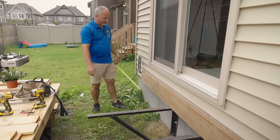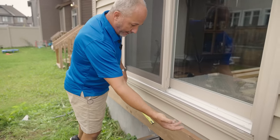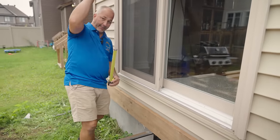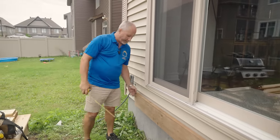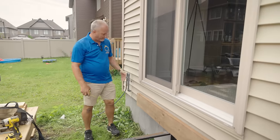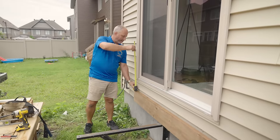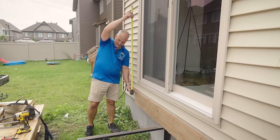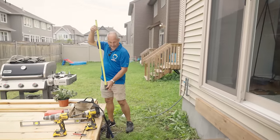But I don't wanna have this much of a cantilever. That's really aggressive. Because we're using structural lag screws on both sides of the steel, that'll keep the deck from flipping up, okay? But I don't have an engineer here on site. So, I'm thinking I'm gonna tighten this up just a little bit so that my privacy screen here will be at this location out to here, and then it'll start back here and then carry on.